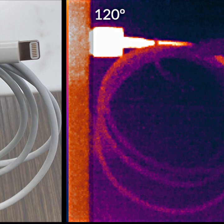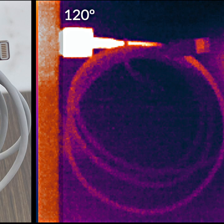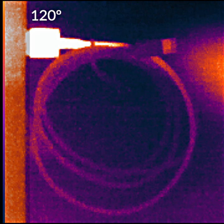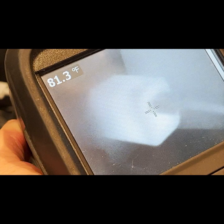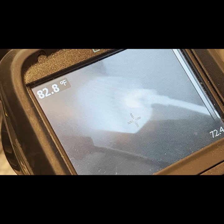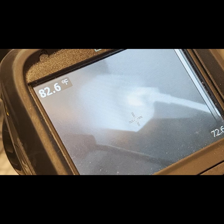When we conduct our corporate technical information security inspections, also called technical surveillance countermeasures inspections, or simply TSCM, we can spot a spy cable from across the room using our infrared thermal camera. Let's test the normal cable first. Now let's test the spy cable. See the difference? The end of the spy cable and the charger is white. White represents heat. The regular cable was more uniform in color. Let's look at that again.